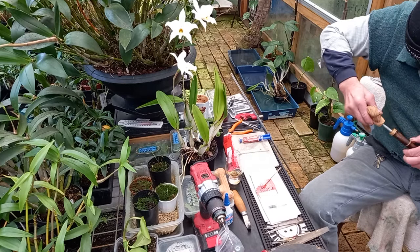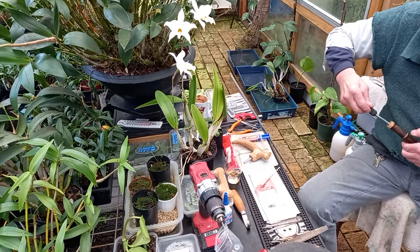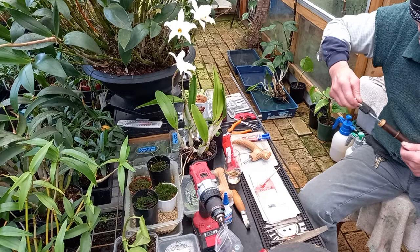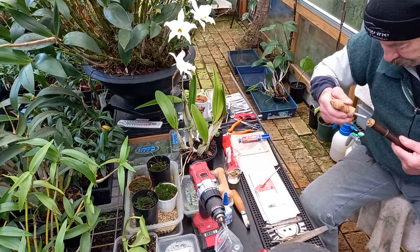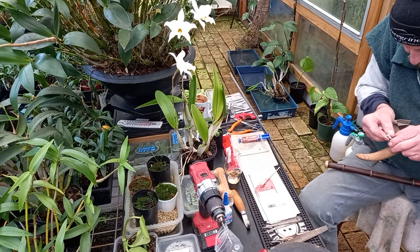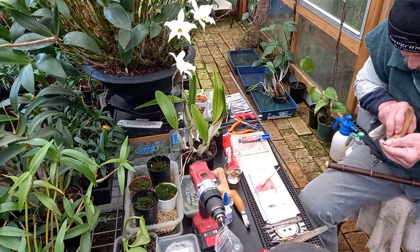Why is that going in? There might be a little bit of a burr. So it's a good idea to run the tap in and out a few times. Clean up any little rough bits. And if all goes well, when you try and run that in, look, I've got wood grain in there. From using originally. I do have a thread file that makes it really easy to clean these up. But where is it? Up in the shed.